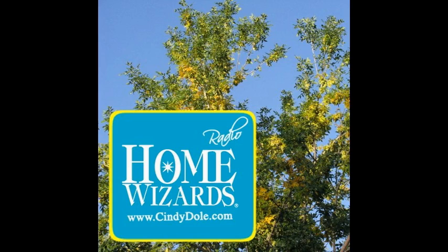If you can't block sun from outside, a shade or closed curtains are the next level — it's long-wave radiation, like a car sitting with the windows up, where heat gets in but can't get out. Also, have nature work with you: open up the windows in the morning to let in that cool morning air, then close them around 11 AM before noon to keep the heat out. You can also diffuse light by putting a film on the windows to tint them — it comes as a film, but it's a little tricky to install; you keep it wet, like fly paper, and as long as it stays wet you're fine.